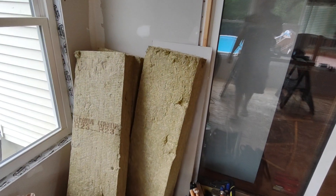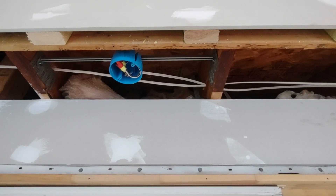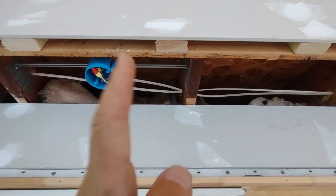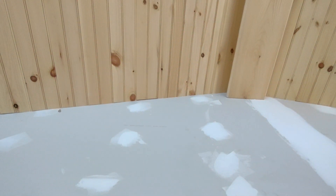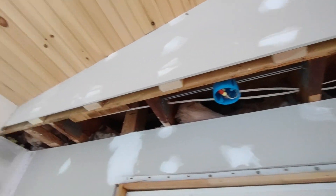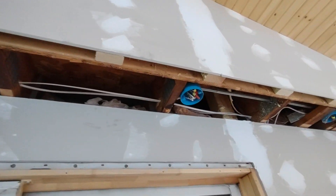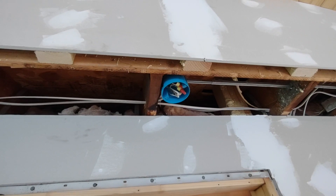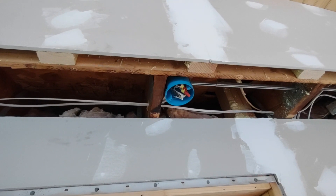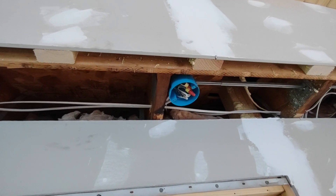I have to stick this insulation up in here. I've got to run a nailer across there because we're thinking about running the beadboard in this direction — same direction as the ceiling. And you're going, how are you going to do that? We're going to try to tie in the beadboard that runs from this soffit down and across. I'm going to run from both ends — either break it in two places or just one in the center. If this junction box was correctly placed at center, that's probably where I'll create a little block, which most people will never notice. But it might actually work out.